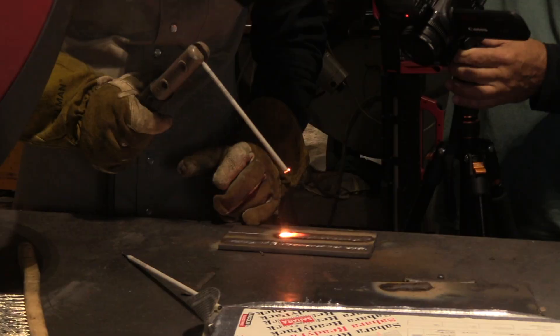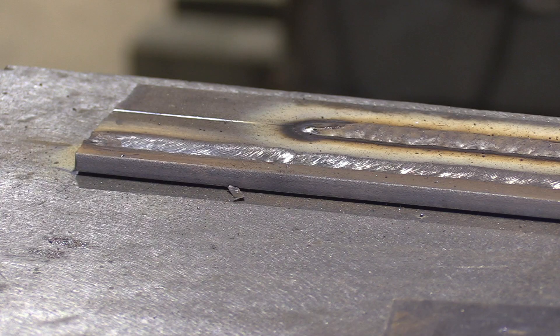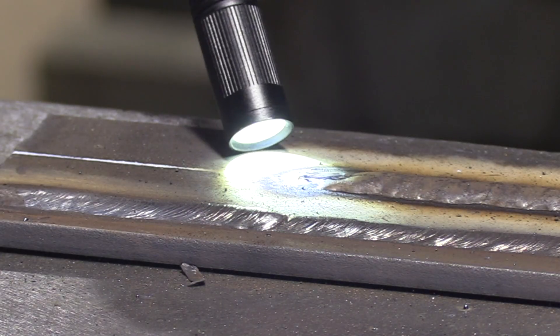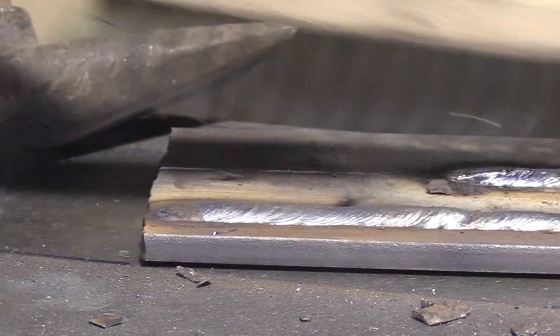We'll do another restart here — we'll stop intentionally, just because we did one on the other rod. Notice no peeler here; the slag is just hanging on there. This is the machine we used for the welding today — it's a shame they don't carry them anymore. They quit selling them due to some kind of supply chain issues. It's a Lincoln Invertech V205T — one of the very first dual-voltage AC/DC TIG welders available in the USA. Let's see how that slag comes off. We're not going to have to beat it off with a needle scaler or anything like that, but it just didn't peel. It came off pretty easy and the bead actually looks really good.